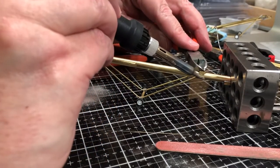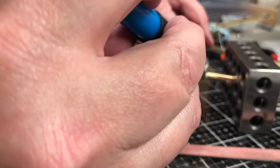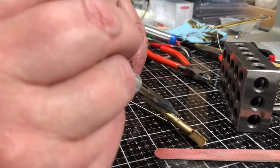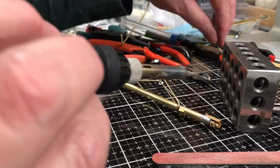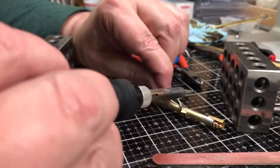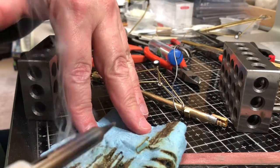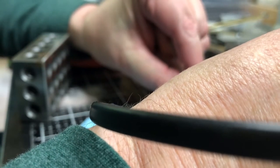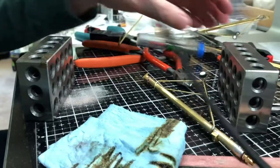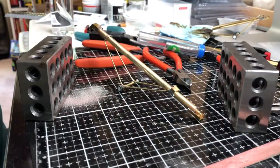Sometimes it's really, really tough to do some of the things that you want to do. And it was really tough at the higher temperatures to keep this tip clean. I realized one of the things I have to do is get one of those stainless steel balls or the brass ball to keep the thing clean — it would have been a lot easier. Here I was able to finally get some sort of tack on there, and then since I got the tack on there, I was able to manipulate this a little bit more. Constantly cleaning the tip to get this to be cleaner. Apparently the brass is a little bit dirtier than a lot of the copper and stuff that we normally work with. All righty — that's my box. That's one good thing away.